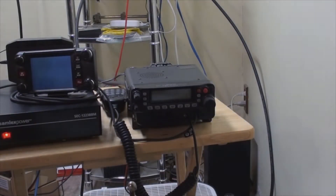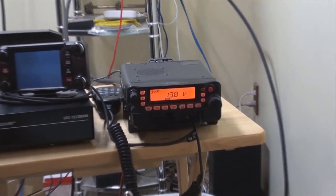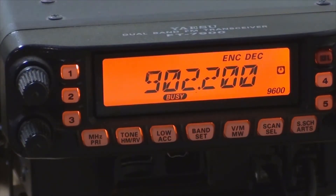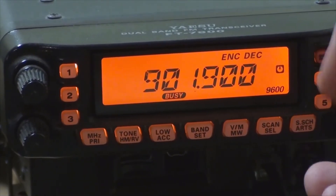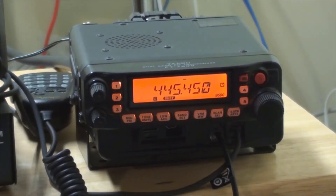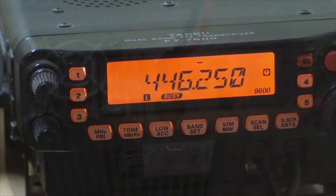In order to play and learn and experiment with the repeater controller, I don't want to be on the main frequency, so I'm going to set up a link radio. I've had this Yaesu 7900R around for quite a while, and it's going to serve really well as the 900 megahertz receive link, but it will also serve as a 70 centimeter crossband repeater. I'll set it up that way, but also as just a straight up link radio so that it's not tied to the two meter side, and I can get any controller feedback that I need to hear.